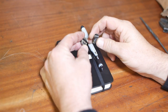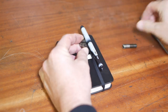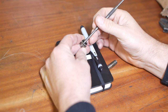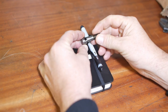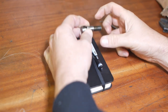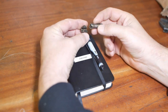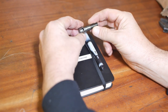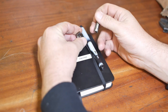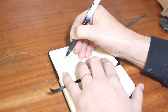You know, I think this design's actually pretty crap. The way you've got this hole intersecting with the shoulder only leaves these two tiny areas, therefore very little steel to actually carry the load. And the second thing is, by pulling this tight, you then lose the rotation so that the bell crank forces a flex into that pull rod. Now, the pull rod's long and flexible enough that that's not really an issue, but I think it'd make more sense to separate the two functions of the shaft and the cross drilling. So if that's our shaft with its threaded portion at the end,